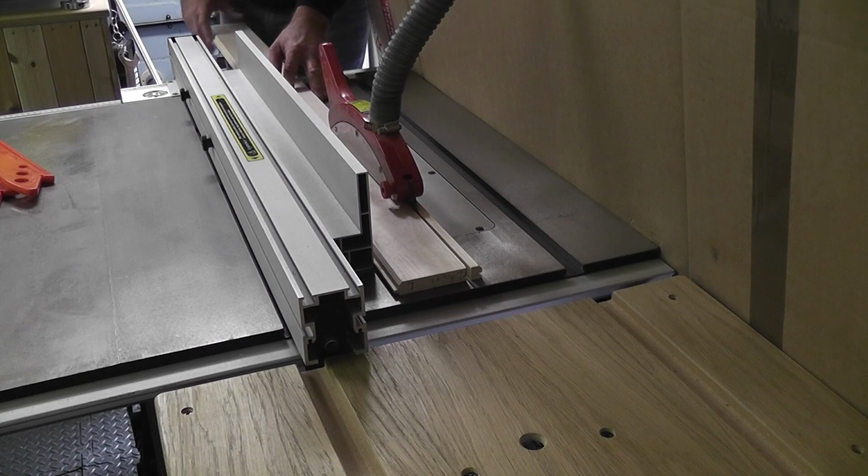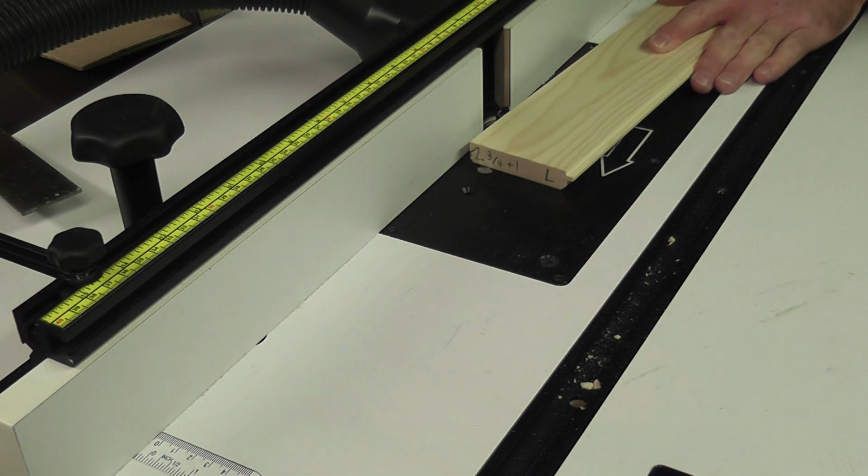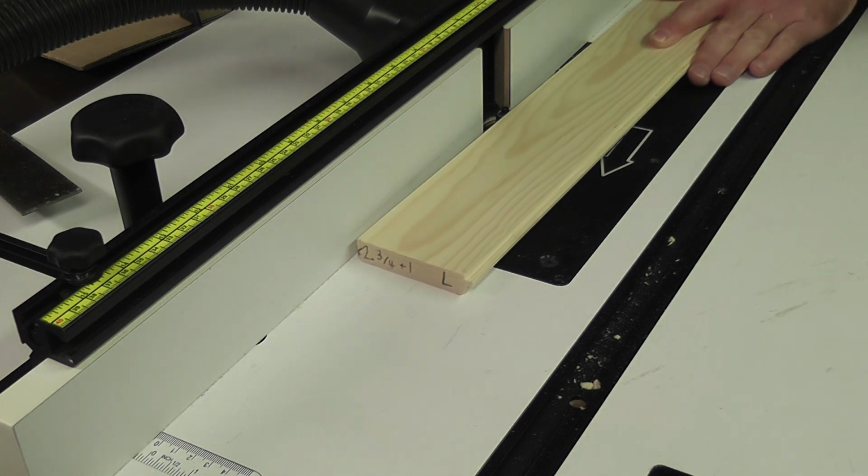Then to finish off the gate, the tongue and groove is added. Each side of the tongue and groove is trimmed to fit and chamfered on the edges for a neater finish. Then after pre-drilling, each piece gets nailed on with lost head nails.